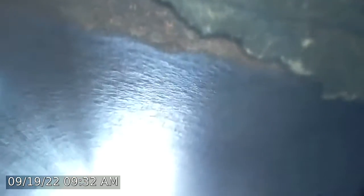Notice there is some creosote present. Staggered flue tile — you do have an open mortar joint. Another staggered flue tile — you do have an open mortar joint, all missing mortar.